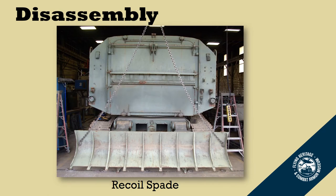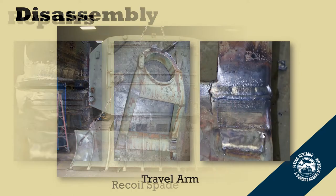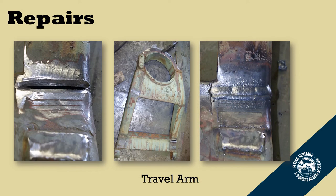Here we're looking at the back of the gun at the recoil spade, which has been lowered to the ground with the overhead crane. The spade is actually raised and lowered with an electric winch and cable housed inside the turret — there are no hydraulics on the spade at all. Among other repairs, we had welding repairs: here for example is a crack on the travel arm, so we opened up the crack, cleaned it up, welded it back up, sanded it down, smoothed it out, and then repainted everything.